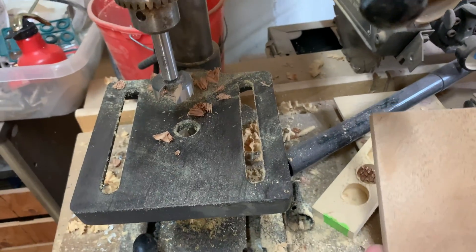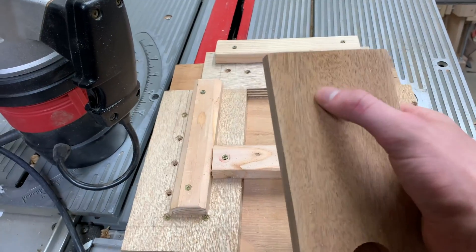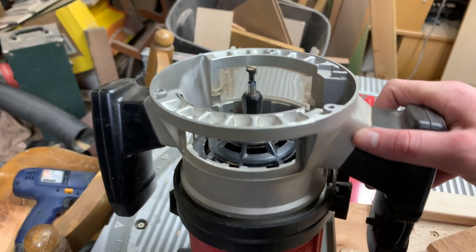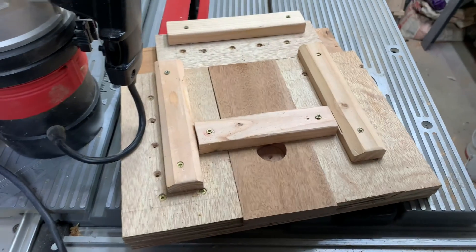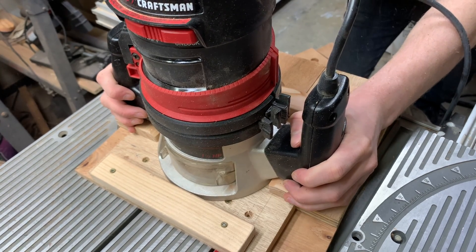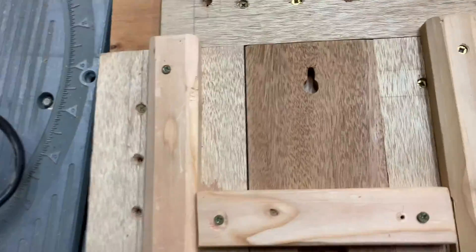I need to put the magnet in here — there's a Forstner bit in the drill press. I made this little jig since I have to make a bunch of these. Now I need to put a little mount on here, so I made this jig to use a key router bit. It makes a little undercut so I can put a screw in. This jig just slides in here — router bit goes down, slots over, comes back and back up. There we go — a nice little slot for a screw.